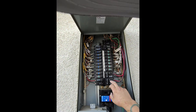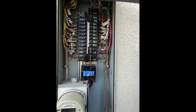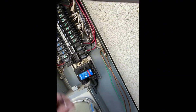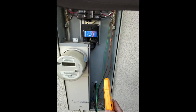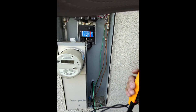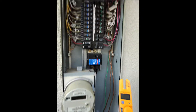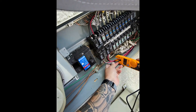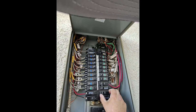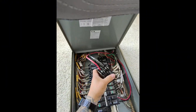I'm going to go ahead and move this oven circuit up there because I don't want what I installed above six foot seven. I didn't install this panel, I didn't inspect it — not my thing. I don't know if they're using the oven so I'm just going to do a quick amp draw on it. Let's see if they're using that — maybe they're baking some breakfast.